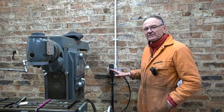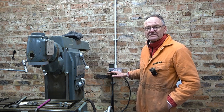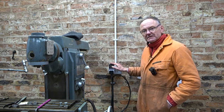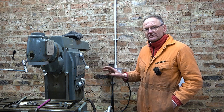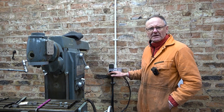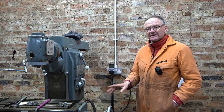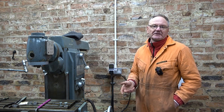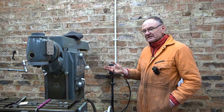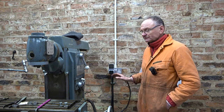And as you probably know, over a short period, you can run that way over 13 amps, maybe even to 20. You're not supposed to, obviously. But I've been monitoring what this machine's been using. And even when it's freezing cold on a day like today, it won't draw more than about 12 amps. And in fact, I tried to start it when it was freezing on full speed and the inverter overcurrent tripped anyway. So I'm pretty confident I won't be running this over 13. When it steadies itself down, it runs back down to about 8 amps, something like that.